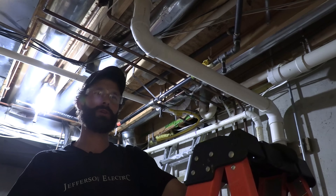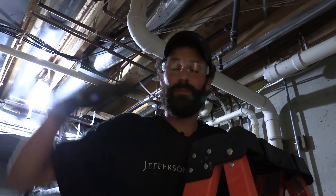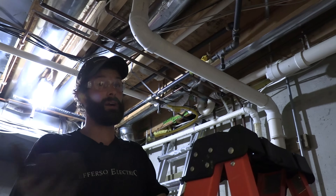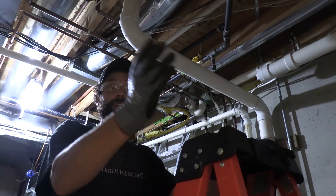What size KW? 24 kilowatt if it was on liquid propane, but because it's on natural gas, it's wimpy — it's 21 kilowatts. That's 91 amps instead of 100 amps, because natural gas is not as efficient as liquid propane. Natural gas generators produce at a lower power than liquid propane, but also come at a lower operating cost and are more readily convenient. You don't have LP on premises.